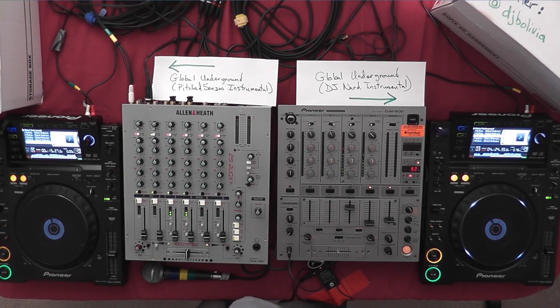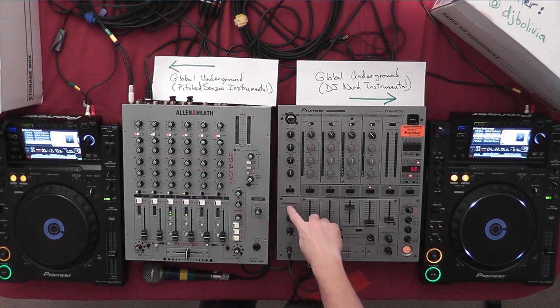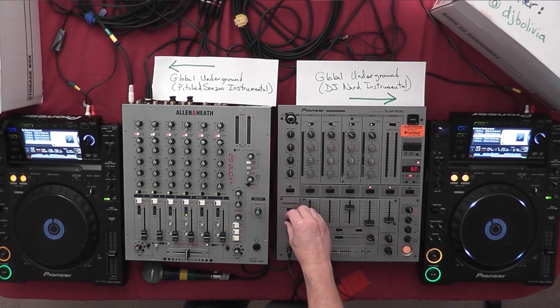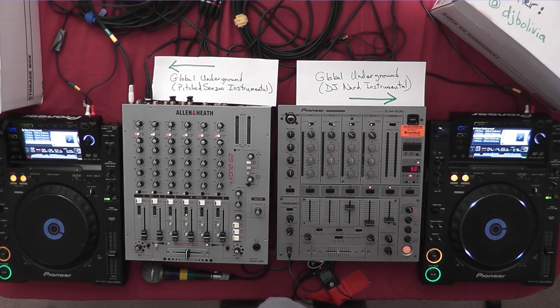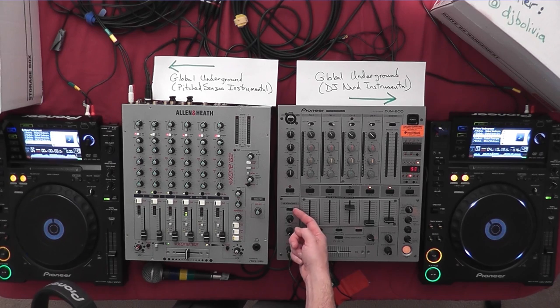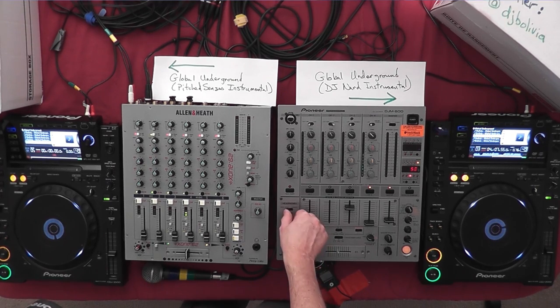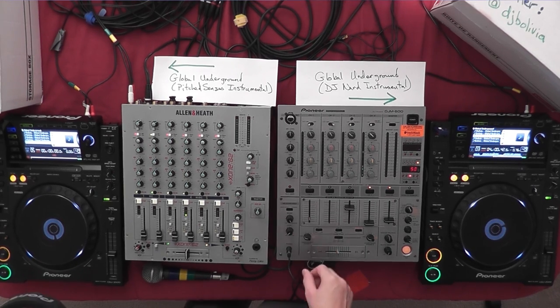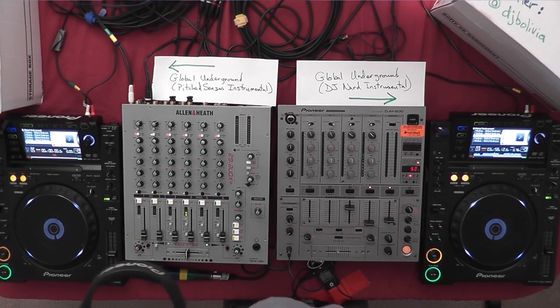Well, this is the tricky thing. When it's on stereo, your Q comes through both ears when you're on the Q side, and your master comes through both ears when you're on the master side. With mono, sorry, that's if that stereo switch was set that way. With mono split, it's the same sort of thing: Q only when you're on the Q side, but only in your left ear, and master only on the right side, only in your right ear. Okay, that's really confusing, eh? Until you play around with it a lot.